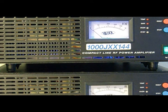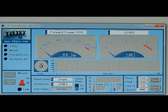There's not so much more to say. Now take a look at the software. The software is easy to install on a Windows platform. The connection to the power amplifier is based on RS-232, but the latest PCs are not equipped with it, so we can use an RS-232 to USB converter from the market. A COM port is recognized, even if converted. Then we choose the port assigned by the system, maybe with a rescan, and activate the connection.